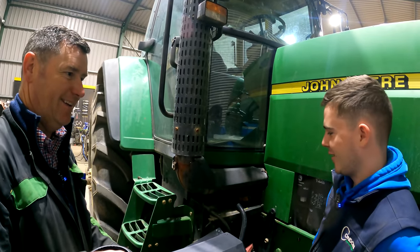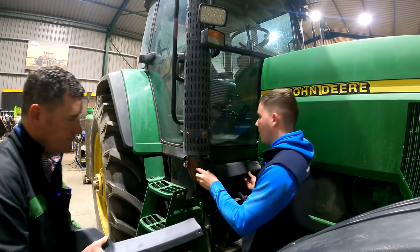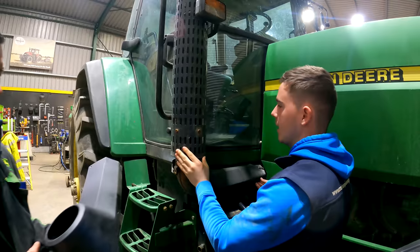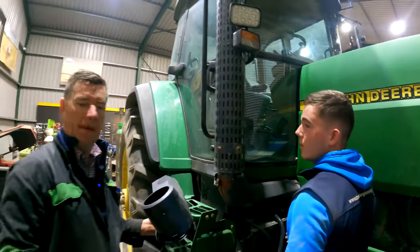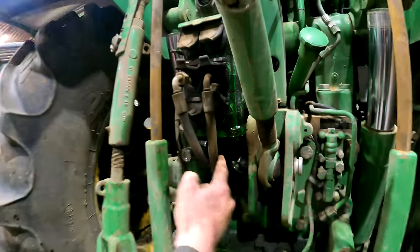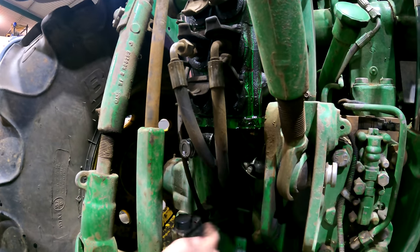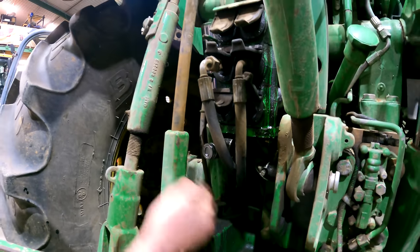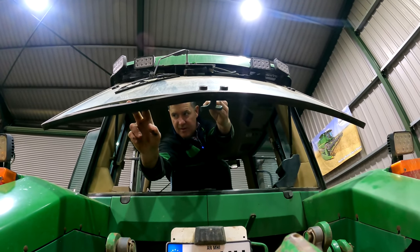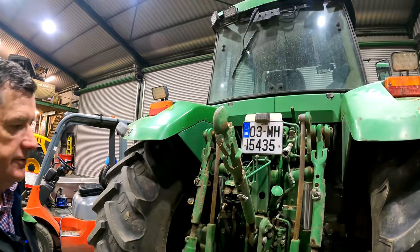So you'll be busy with that for the day — get it done anyway. Your pipe might have to split in there. I'll take this off and see how I get on — if I can get it out I'll get a bit more height when that comes off. Just another small job we have here: a little bit of an oil leak from the runoff from the spool valves. There should be a little pipe there that goes from there back down into the bottle. We also see a little bit of a seal on the back window has dropped, so probably need to clean that out and add a little bit of clear sealant to keep that in place. After that she's good enough to go.